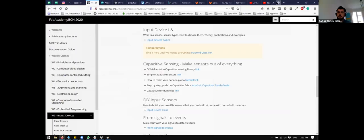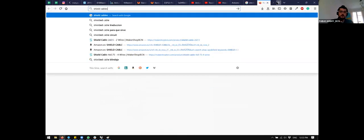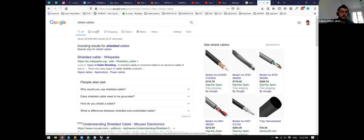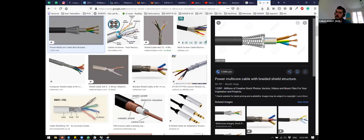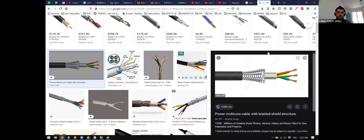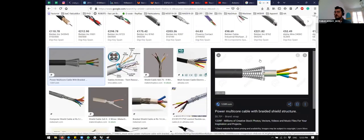There's also a type of cabling called shielded cables that is really useful. HDMI cables, for example, always use this: you have the wires and a grounded mesh around them to avoid interference between cables. You usually only need this if you have really small digital signals that could be interfered with by an adjacent power signal cable. That's also one of the main reasons you can find HDMI cables ranging from 3 euros to 100 euros — the expensive ones have two or three layers of shielding between cables, made of aluminum, gold, or copper.